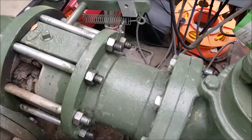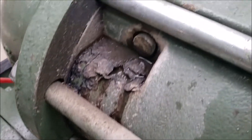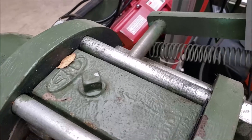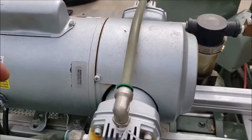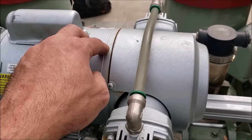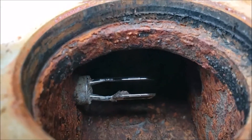One last thing — when we got this pump fired back up, you can see we have a little bit of leak on the seals of our check valve here. Having this leak on the check valves could possibly make you lose vacuum prime too, though if you have the big vacuum pumps it'll often overcome a lot of these little leaks. But just wanted to cover all the bases. Last but not least, if you have no obstructions and right up to this point you're not getting vacuum, obviously check this hose for cracks or leaks, or you may have actually burnt out your vacuum pump. Smith & Loveless sells rebuild kits for these. There's not too big of a channel that goes from the inside of the housing into here to sense the prime.